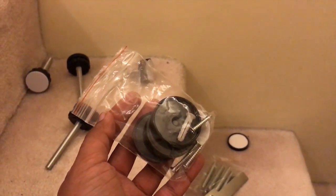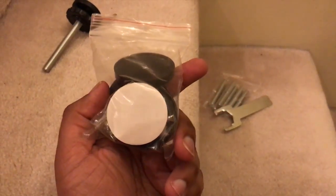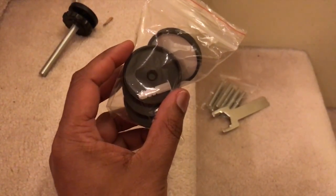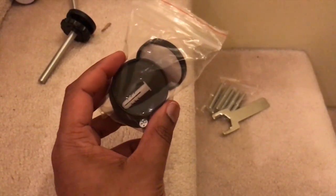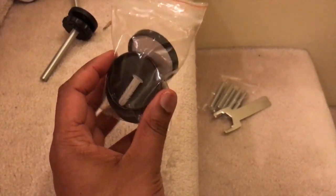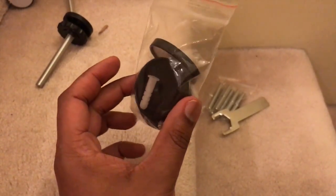Otherwise, you can also do hardware mounting, which requires you to do the same pressure mounting, but you can also install with these things here. When you're hardware mounting a gate, you've got to take those little bases that I've got in my hand there and drill holes and screw these into your walls. Following that, you would pressure mount the gate to those. For the purpose of this installation demo, I won't be doing that, but I'm going to show you the after effects of a wall that's had a hardware mounted baby gate so you can see what it endures during and after the mount.